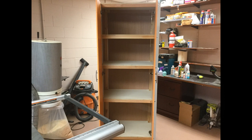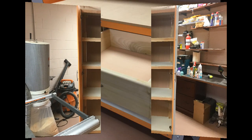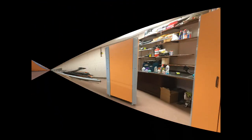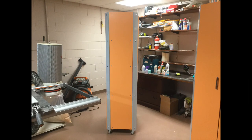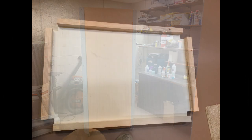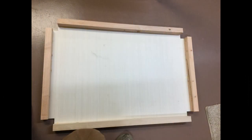You have great flexibility in how big a cabinet you make. You can put doors on it like this one, you can put drawers in it, or you can just leave it open. I like to clad the sides and the rear with material to close it in, but there is no reason why you have to. The construction is very solid. But the second thing to understand about this cabinet is that it is almost glueless construction — the only glue in this entire cabinet is the edging on the plywood for the shelves to provide additional support.